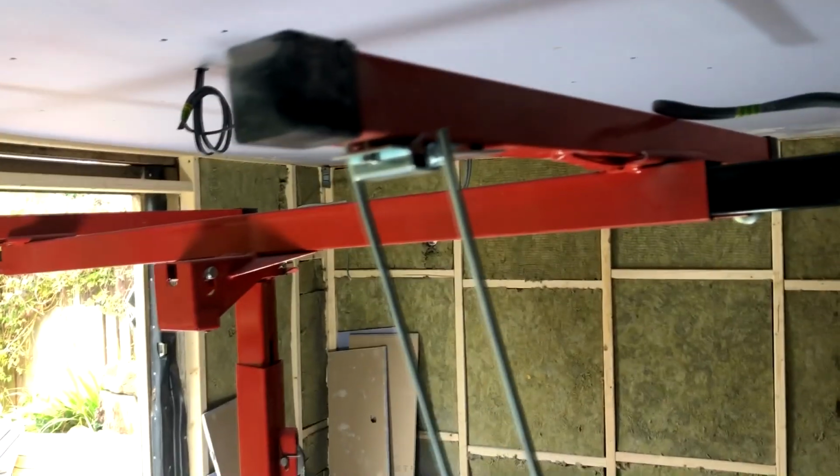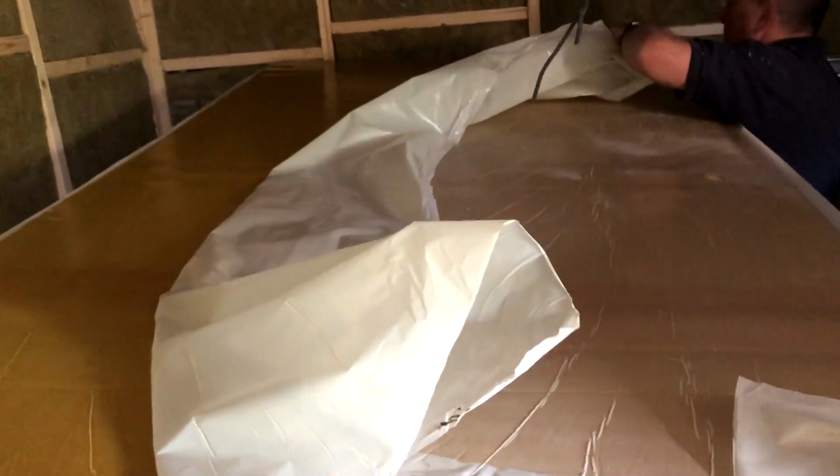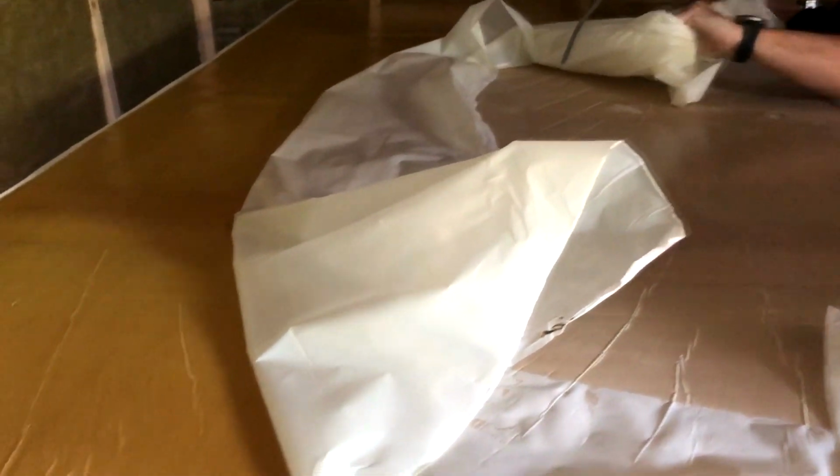Then what we're doing is we are laying another board on our drywall lift, putting the extremely heavy Tech Sound on it, hoisting that up. And then we have longer screws to go through that. Again, it's going into the hat channels. You can see a couple of misfires there. And these are 3.5 by 55 mil screws. Let me grab one of those.